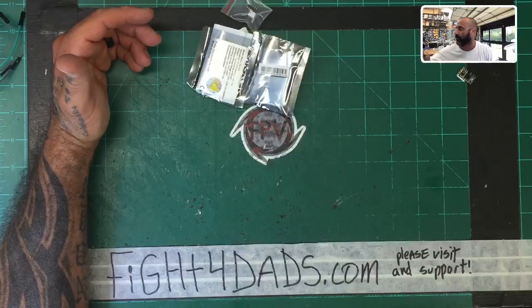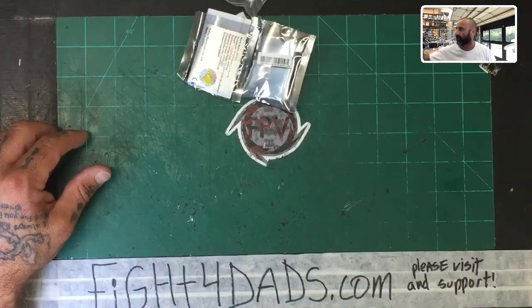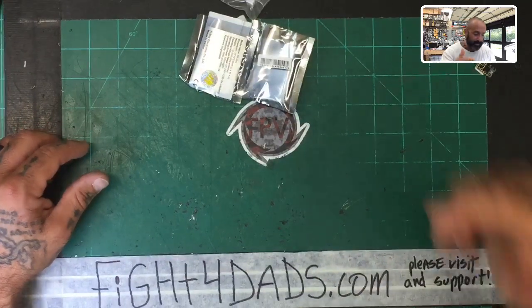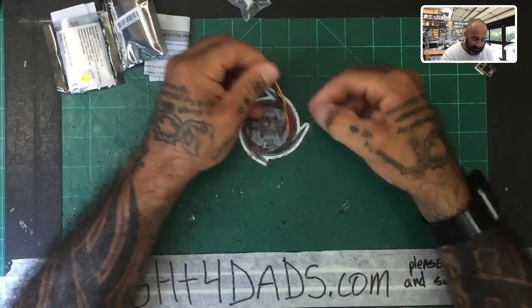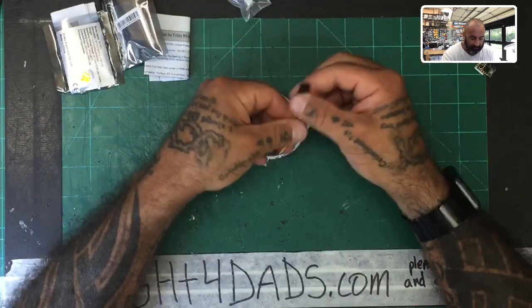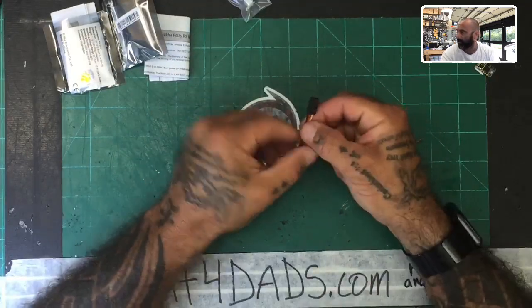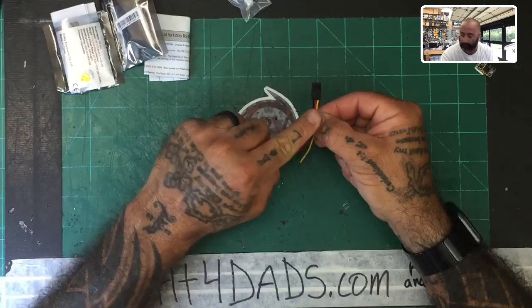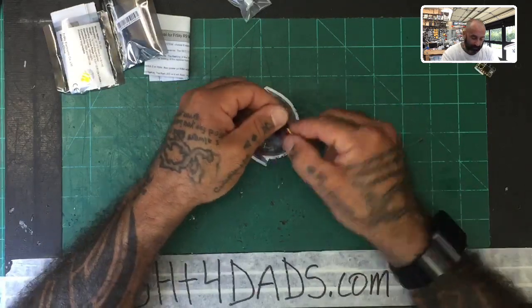I'm going to swap screens here and go this route. Okay, so first thing I want to do, let me try to get this to zoom in just about right there. Okay, so this is a regular cable, right? On a cable like this, which I've cut and is actually used for something else, we've got our three pins: ground on the left, our positive in the middle, and our signal on the right, our S port.